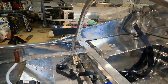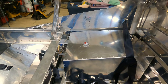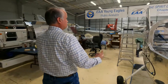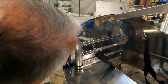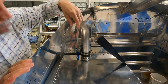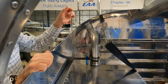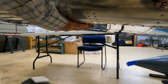The other thing we accomplished was installing the fuel tank. In doing that, we also needed to fabricate the overflow lines. The Vans kit provides all the aluminum tubing you need, and the construction drawings tell you exactly how to bend the lines and what the sizes are for a good fit. The overflow connects to the overflow port on the tank, goes back through the bulkhead, makes a couple of 90-degree turns on the backside, and then goes straight down to the bottom of the fuselage, coming out through the drain port.